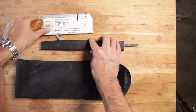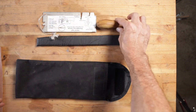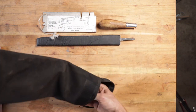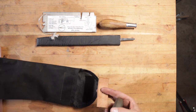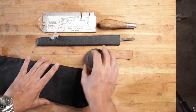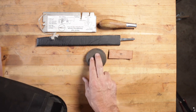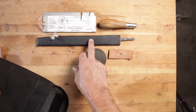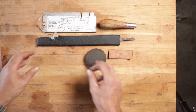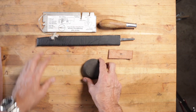You're going to have an official FSS sharpening guide, which I'll show you how to use, an official government U.S. wood sharpening file handle, a piece of safety leather guard, and a Lansky puck which is my own addition. I feel the file is a little bit too coarse, especially if you're a faller using your axe for chopping — it's nice to finish it off with a stone rather than the coarse file.